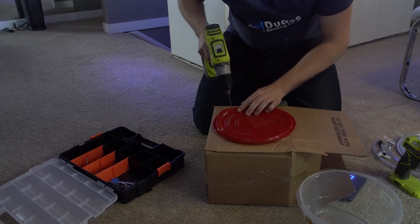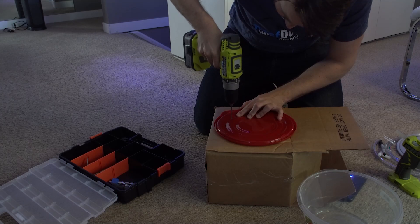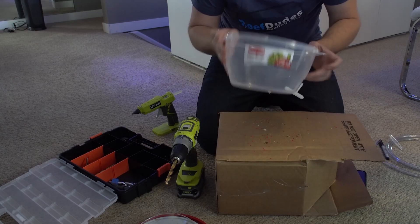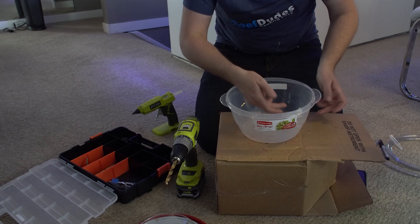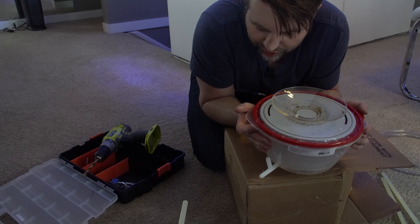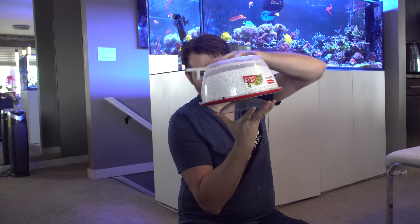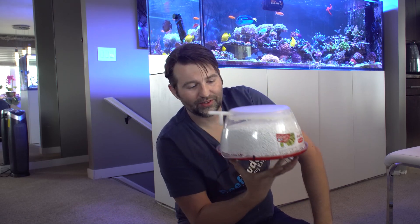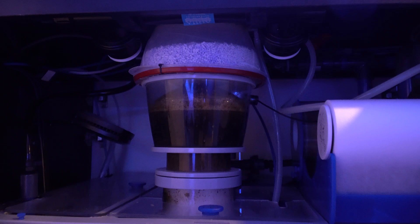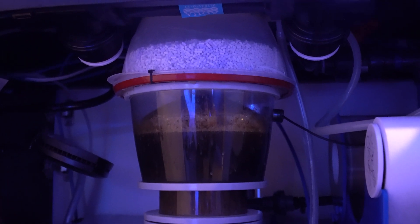A little while later I decided to simplify it and made a little DIY skimmer-top version — cost like 10 bucks to make, dirt cheap. This basically sits on the lid of the skimmer and recirculates air. I already had the fresh air line from outside, so I put a tee into it so it pulls partial fresh air in and partial recirculating air. The recirculating part goes through the CO2 scrubber on top, and the other chunk comes from the attic — a hybrid approach that seems to be working pretty well.